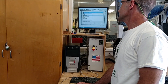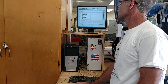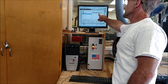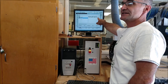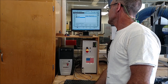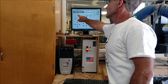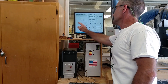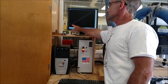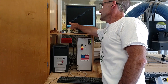It's on the E drive, under Schwartz. I go down to notebook, then the notebook folder, final binding comb hold — .nc. An .nc is my numeric code file. I click on that. Pre-process. It has a 1 minute 43 second run time. Within that, I want to preview it. This is the origin I'm setting — I can see it's offset that three quarters of an inch. It's going to travel over here; these are every step that's going to plunge down.